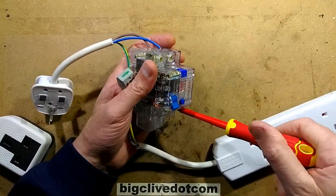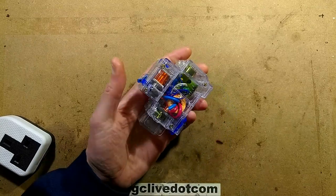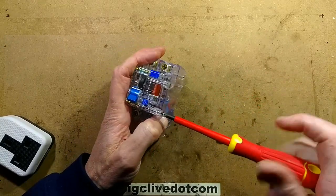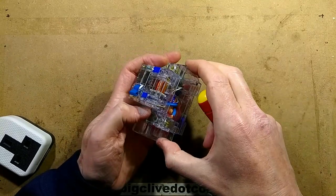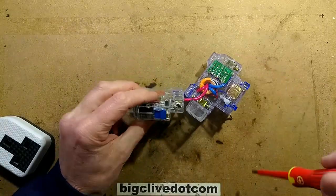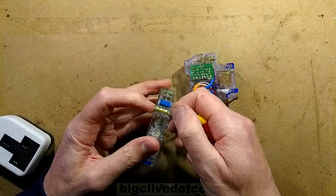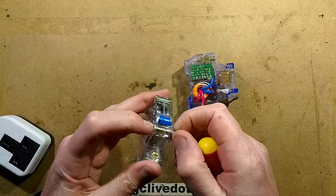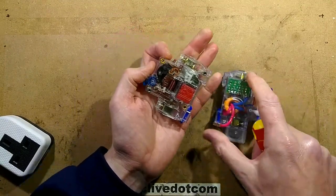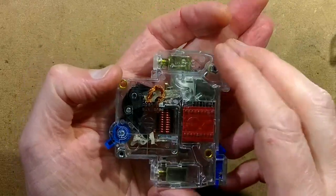Popping the wires out, then popping the two sections apart. Removing the screws — and yes, it does separate. It's very clear that this is just designed to clip on: this on its own would just be a standard circuit breaker. It's got the standard hardware, so this could be used as a standalone standard circuit breaker. Let's take a look at that first — I'll zoom in a bit, though I'm not sure how well this camera does zoom.